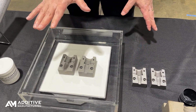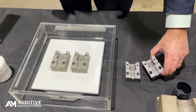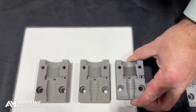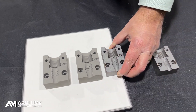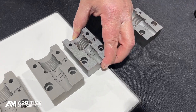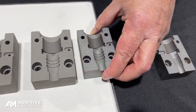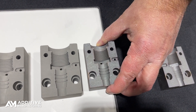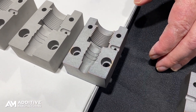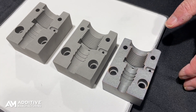These are green parts, oversized because of the shrinkage that will occur during sintering. Here is the actual completed, fully dense, fully H13 tool after sintering. Part of the system's precision comes from very precise predictability and control over shrinkage — to the extent that Mantle is able to promise a precision of one thousandth of an inch per inch of the part.